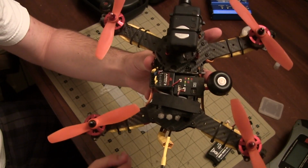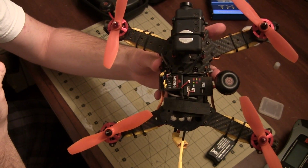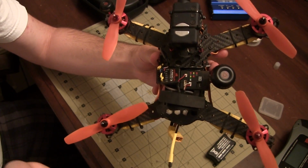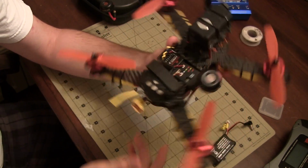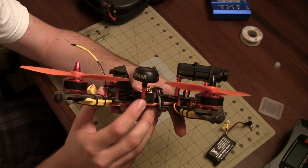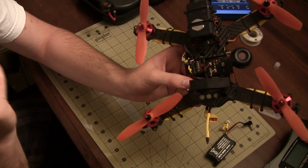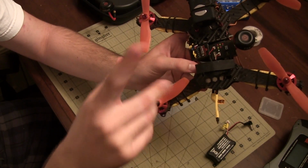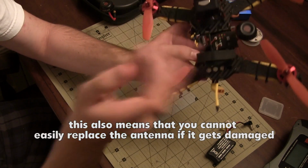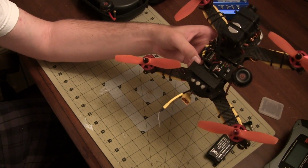And the major problem there was this transmitter. It's a good thing. It does what it's supposed to, but it's built pretty cheaply and bulkily. Also, you can't change where the antenna comes out. It always has to be attached to this in just that way. A lot of times you can reroute the antenna to different parts with coax wire and have it come out where you need it to. But I had to find a place for it where it wouldn't get hit by the propellers.